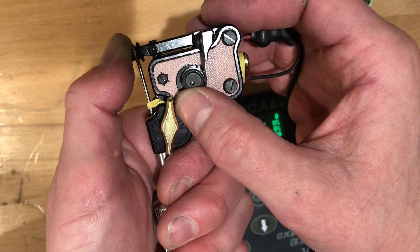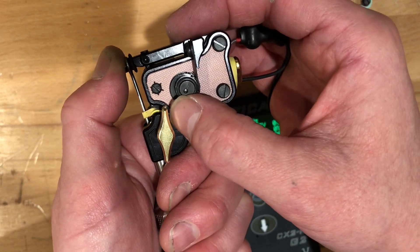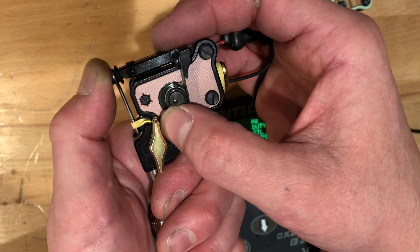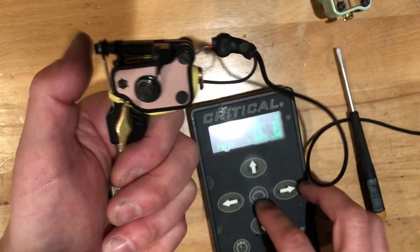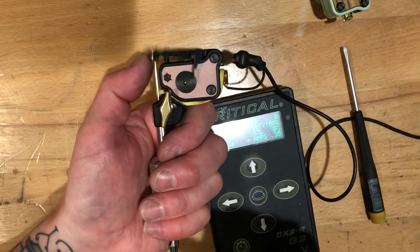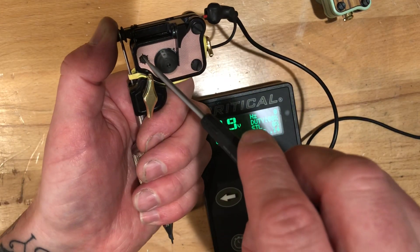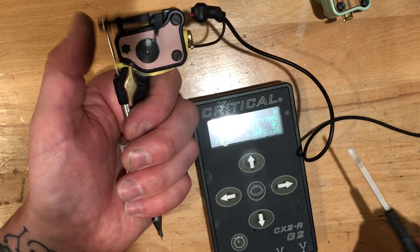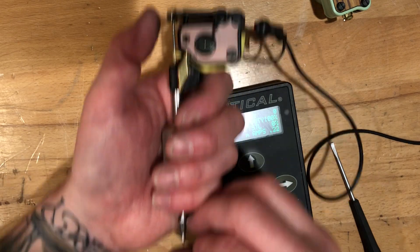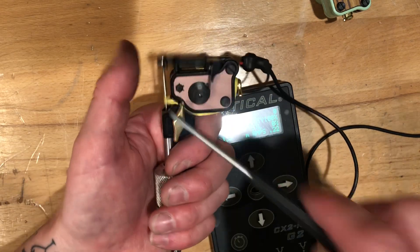You can see the little line on the cam, and it's a little bit lower than the timing mark on the side plate. It's running pretty well, especially at 6 volts. At 4.9 to 5 volts it's just a little weak — run your thumb across there barely and you can hear it stammer a little. That's when you know you need more impact.